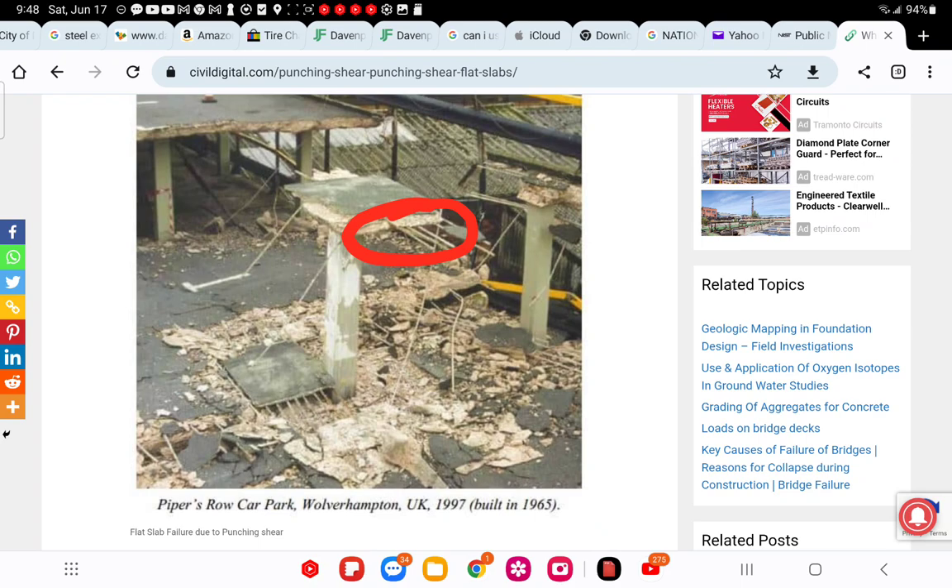I call one 'punk shear' and one 'punching shear' to help me think about them — one is punching through the column through the floor, one is through the top — but I'll just say punching shear for everyone. This case was probably overloaded because they put asphalt on top of concrete and then loaded it many times cyclically. It becomes a brittle connection, especially with repeated loading. In our case, we have critical shear zones that all failed — every last one of them.